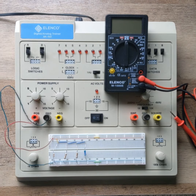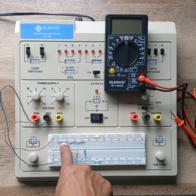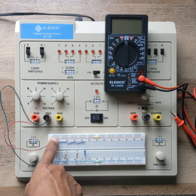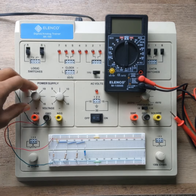Right now my circuit board is off. Take a minute to look at how everything is wired. When you're creating your circuit, it should be wired pretty similarly to this. To make sure it's wired correctly, always follow the path of current. Make sure there's a connection from the power supply to the vertical bus, and from the bus to the resistors receiving power. I use these wires here to cause the current to split, though the resistors could have been tied directly up here as well. So we have four paths.